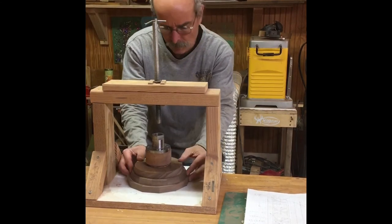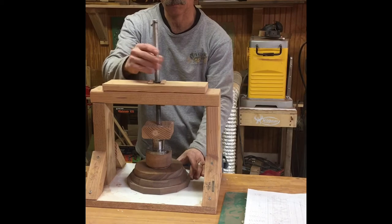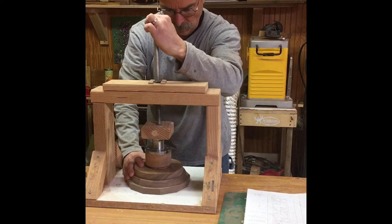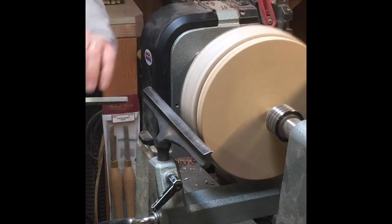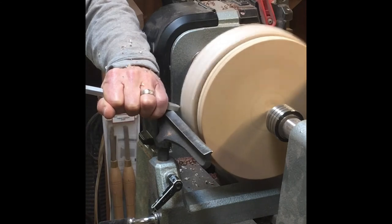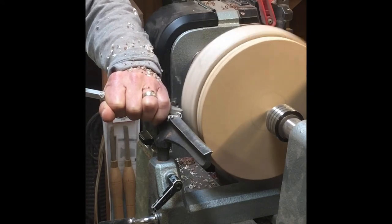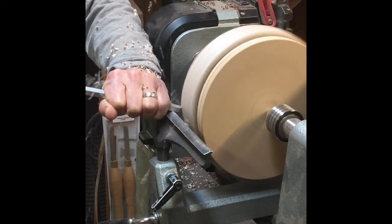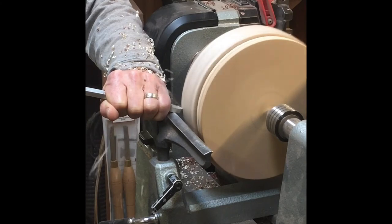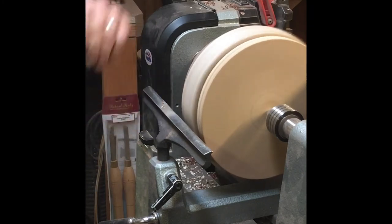I know some people like to glue up multiple rings at a time. Since I'm limited with my sander and don't have a standard two-sided drum sander, I just do rings one at a time. After each ring is glued on, the piece is placed back on the lathe and I use either a scraper or a bowl gouge to round out the outside, getting it roughly rounded — most of the fine contour work is done at the end after all the rings are glued up.